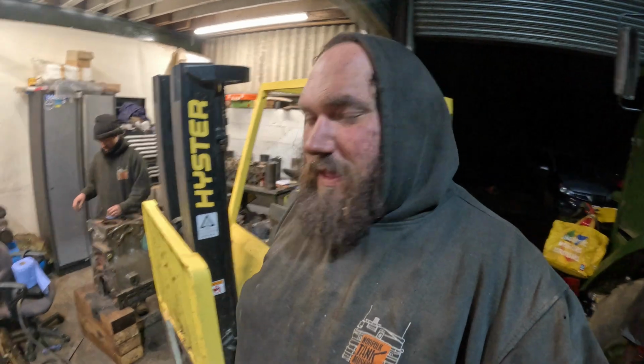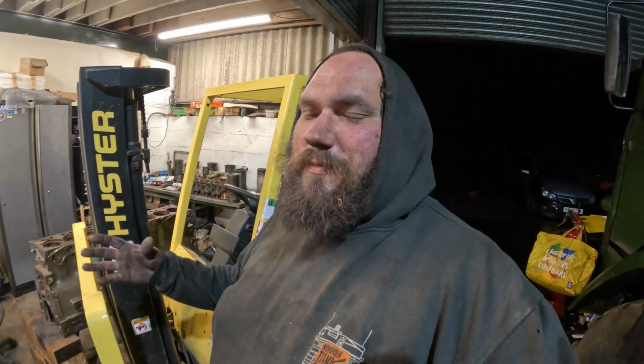How do we repair a cast iron engine block? There's two main methods. One is welding, the second being cold repair, cold stitching. Welding doesn't always work. Cast iron has a tendency, as it cools rapidly in one area, to crack and carry on cracking, and will crack away from the weld. It's notoriously hard to get a weld to stick to.